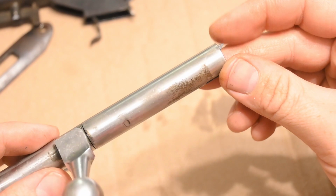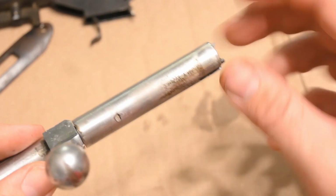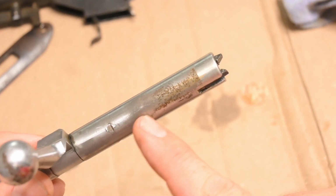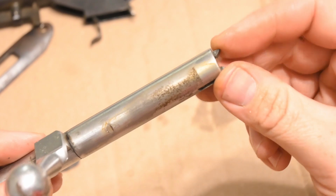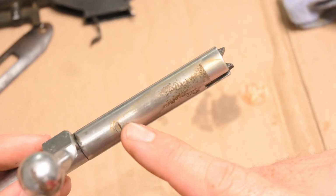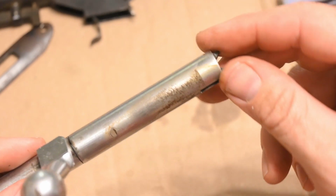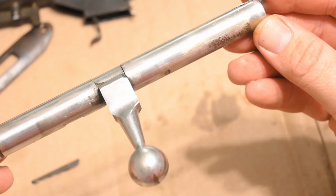So I do notice on our bolt a little bit that we're getting some, you can't hardly tell it, but there's a color difference, like it's hazed here. So we're getting some scratches from the penny on this. I'm not gonna use the penny anymore. I'm gonna switch to the copper scrubber and see if that makes a difference on that. Because it's not something I'm gonna polish out right now.